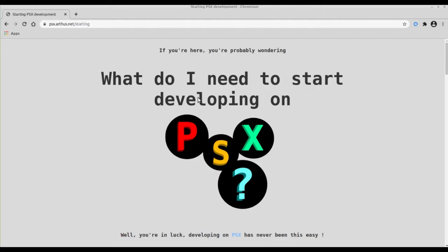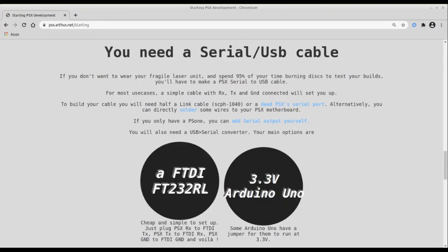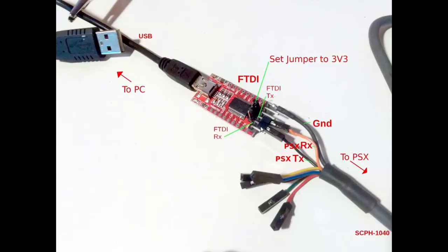To make the actual cables, I first heard of the three-wire mod through this site and they go into detail using two boards — the FTDI (cheap) and an Arduino (expensive, which is a bit weird). This is the cheap FTDI board — I bought one almost identical to this. It's a mini USB, not micro USB, so if you have a PS3 cable for charging controllers, that's what this is.